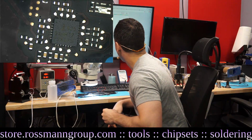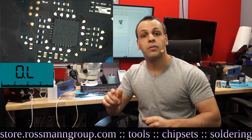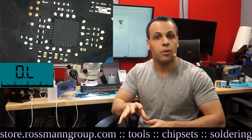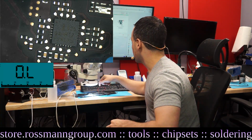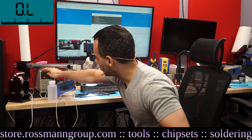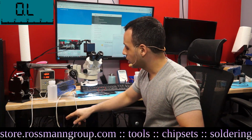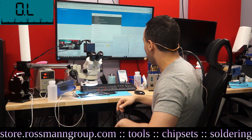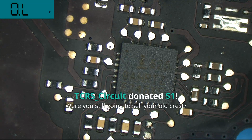What I've done here is hook up my multimeter, which I can get on the screen over here, so you'll be able to view the voltage of the PP Bus G3 hot circuit in real time. So we can see if the voltage goes up or down as the machine is on. It's going to be powered by my power supply, my Circuit Specialist PPS 2116A. I got a link in the description below. And I've hooked it up to a MagSafe adapter so that we can see the power that it's using. And this is going to be fun. So this is what the circuit looks like at the moment. We are going to get this thing turned on.